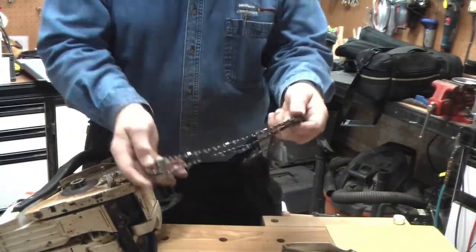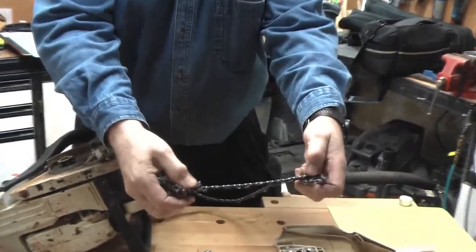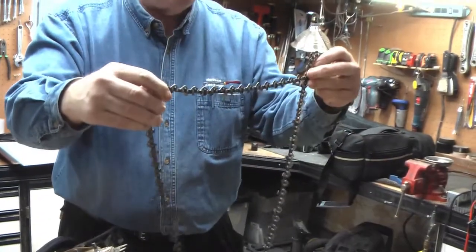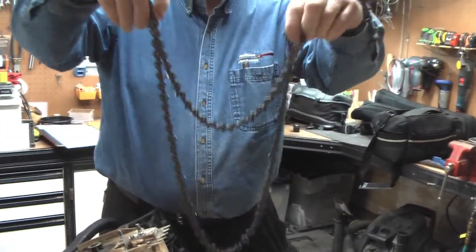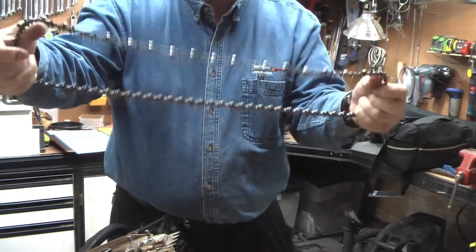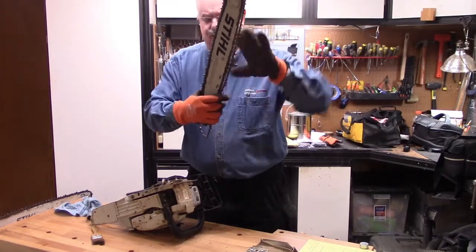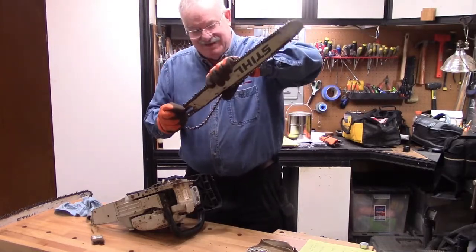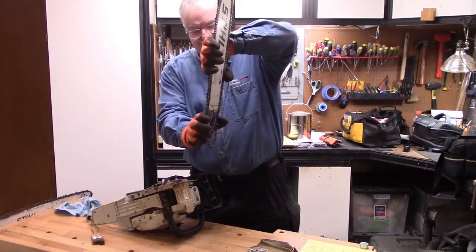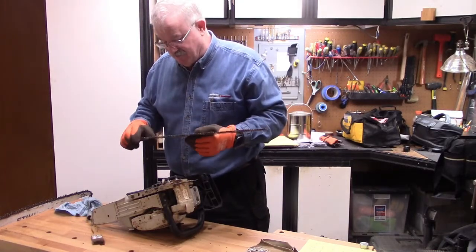I also recommend a little natural bristle brush. Now we've got the classic kink in the saw chain — so how do you get it out? What you have to do is get the chain on the same side of the loops. The easiest way is just going back and forth until you have the chain on both sides of the loops, then just pull it up. When it comes to putting gloves on while reinstalling the chain — it's not necessary, but a good idea isn't always necessary.